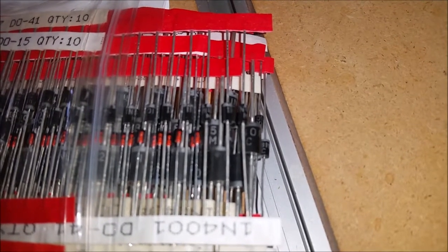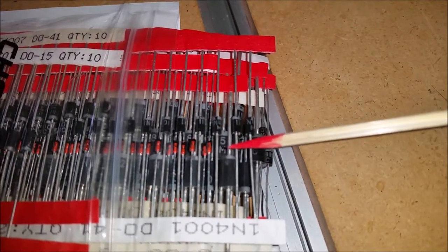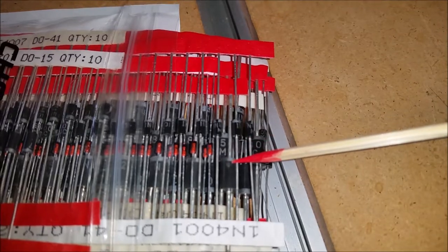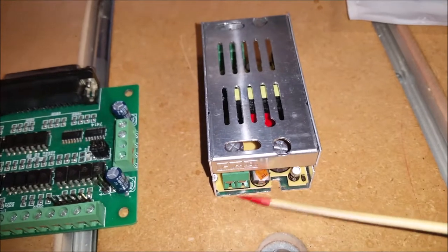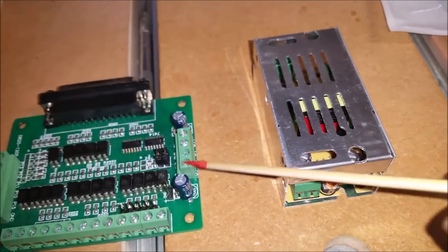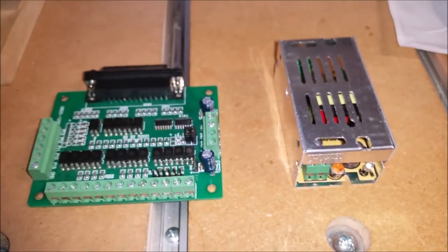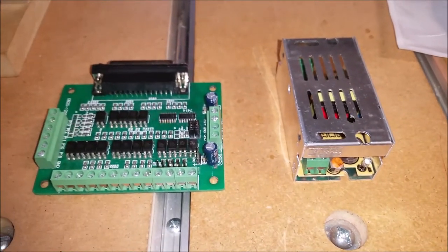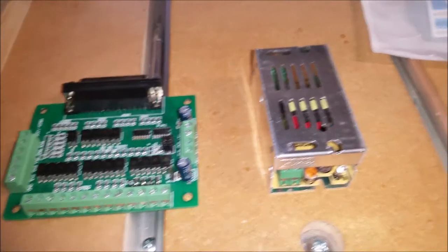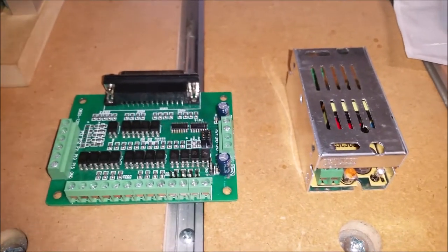The gray ring on the backside of the diode indicates your direction of flow — current flows toward that ring and cannot come back through it. You would install the larger black section facing your board, with the ring pointing up toward the power supply, so that residual voltage can't come back. If you don't do that, you're going to have some undesired results, and you should probably install it anyway whether you do what I did with this or not.